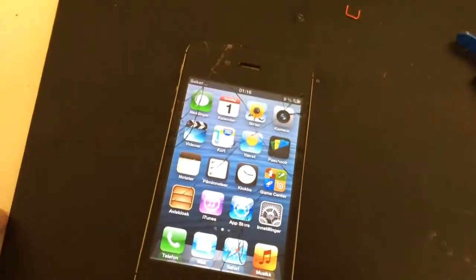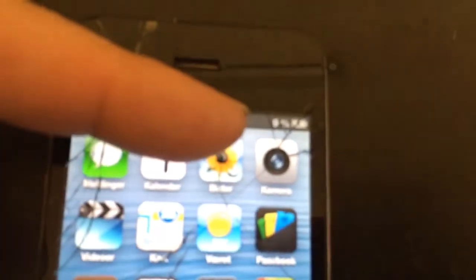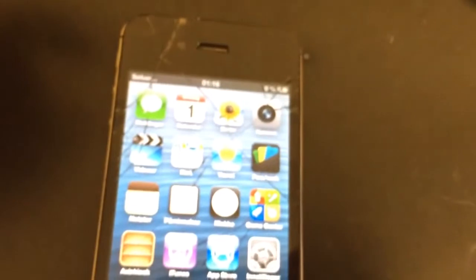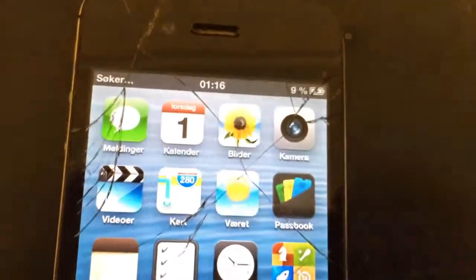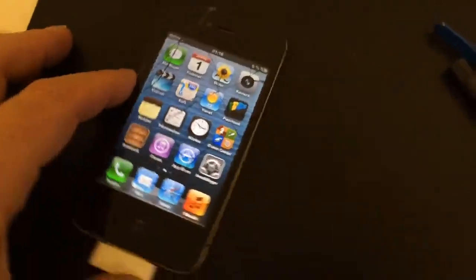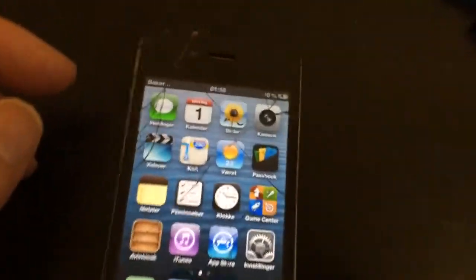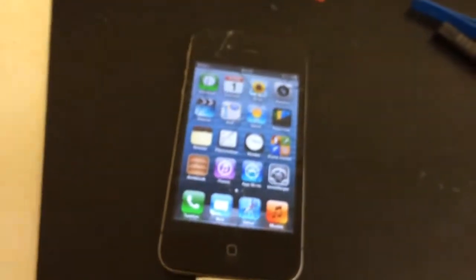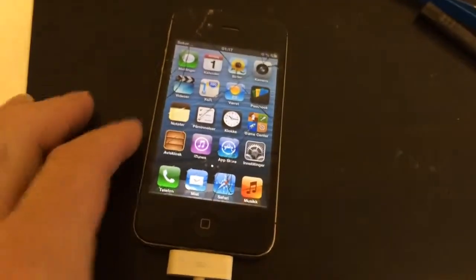Okay, then here we are. We've got the device switched on and charging. We left it a few minutes. Obviously you can see it's up at 9%. From what we've seen, when batteries are flat in devices like this, which this was, it needed charging up. They switch on at about 4%, so there we go, it's just increased from 9 to 10. Now what we found, when it restarts, the percentage increases, but only when it restarts.